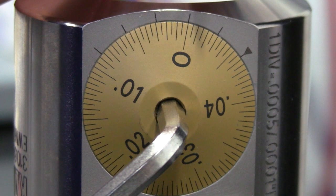Now that we are ready to make a diameter adjustment, we must first determine which gold dial line matches up with a vernier line — that is our starting point. In this example, the zero line on the gold dial matches up with the third vernier line.